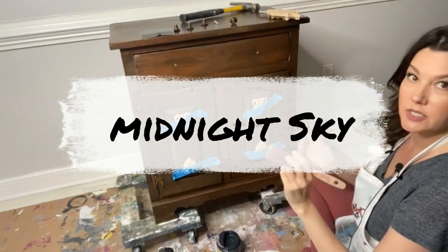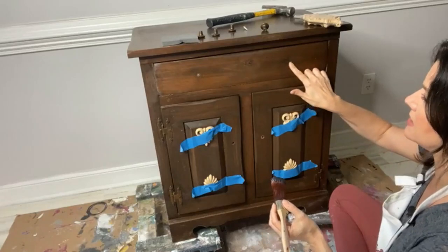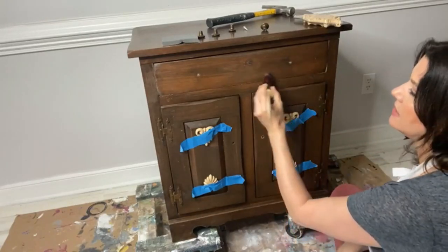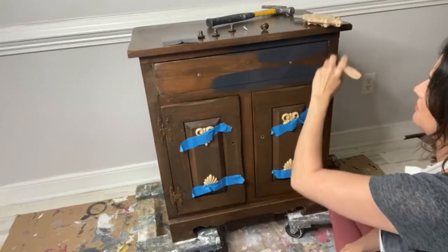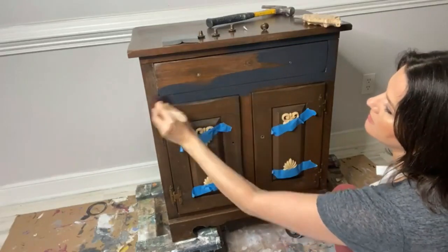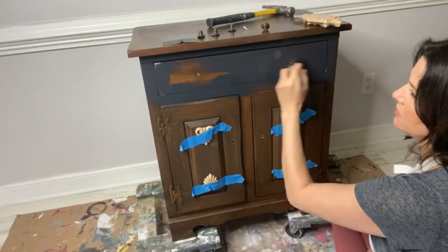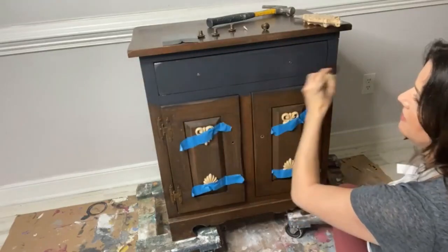The other tools you need are gloves if you don't like getting messy, paper towel or cut-up old rags, and one brush — it really doesn't matter what brush because this technique is put it on, take it off. I'm dipping into Midnight Sky and starting at the top. I've taken out most of the hardware but some screws are stuck, so we're working with what we have. I'm just painting it on — we're not worrying about specific coverage. What you want is to get this paint inside any scratches, chips, knots, or marks, pushing it into those holes.